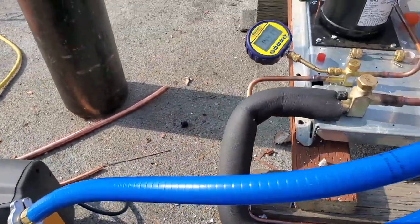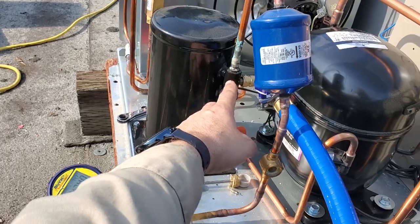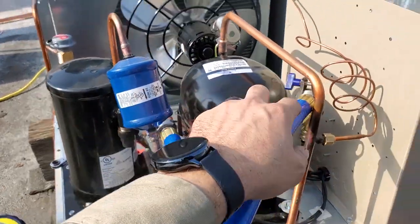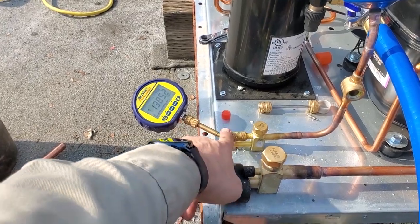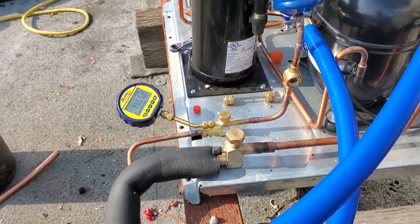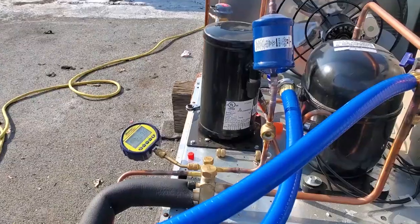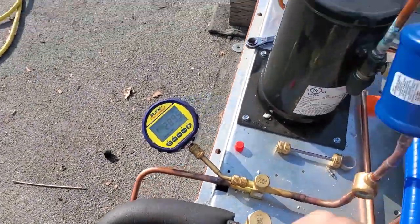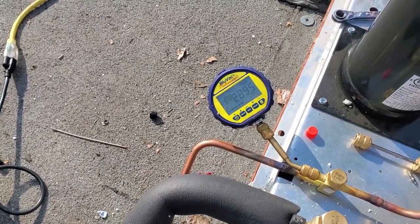I just closed the gas ballast because we're going to go away. We're at about 1400 microns right now. I have this side shut off — initially I used it to pull the system down for the initial pulldown, but then I back-seated the valve, so we're not pulling from this anymore. We're only pulling from the suction. I've got my micron gauge on the liquid line, so we're pulling all the way from the suction back up to the micron gauge so that we're getting a true vacuum reading of the system. We're at 289 microns and I'm going to shake the compressor and agitate the oil to get the nitrogen to boil out of the oil.